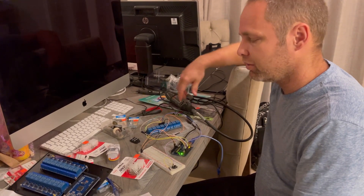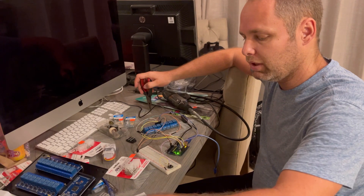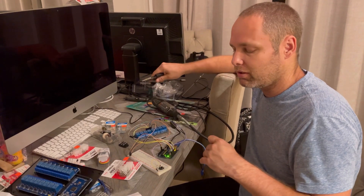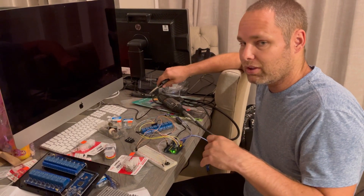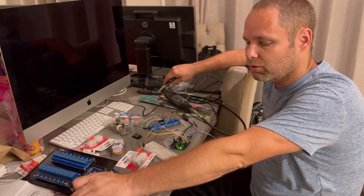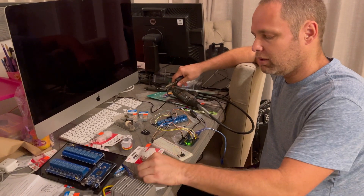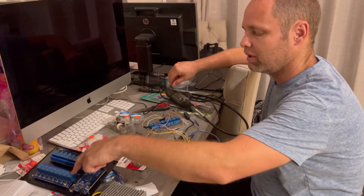So that's what we're working on. I also watched another video from the channel beginning this morning — he talks about redundancy. One of the things he did is we will have a very small battery bank, just for the sake of having a battery bank on our inverter. When that battery bank gets charged by the inverter, we will take those 24 volts and run them to the buck converters and step them down to 12 volts to run our 12 volt systems. The thing is, if that small battery bank dies, we won't have lights, and that would suck. What he put together on his bus and detailed out really well is kind of doing the same thing as these relay boards.